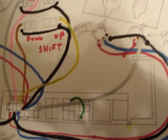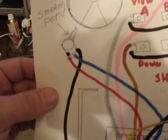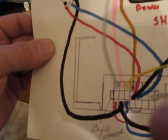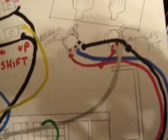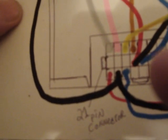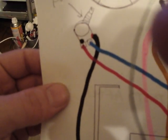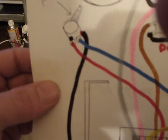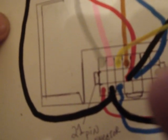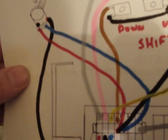Now for your steering — make sure the wiring is exact. Don't swap these wires around because if you do, your car will just spin in one direction. We already covered the far right pin, which connects to all of the brake and gas pot wiring. The far left pin on the steering pot, wire that to the fourth pin in on the second row — one, two, three, four. The middle pin on this pot, wire it to the fifth pin in from the left side on the middle row. By doing that, your steering is completed.